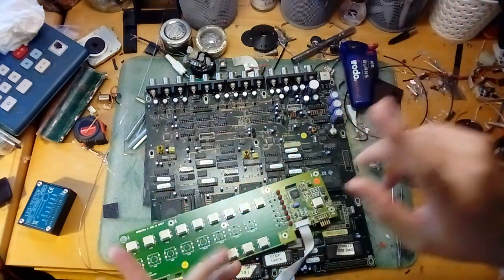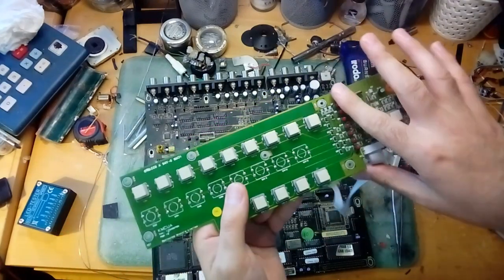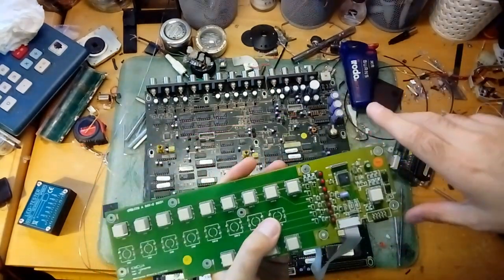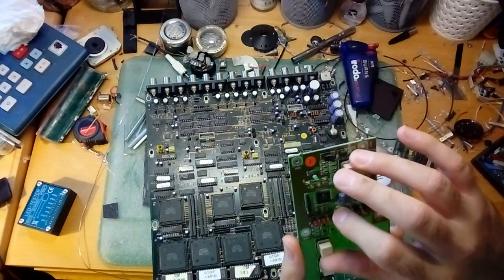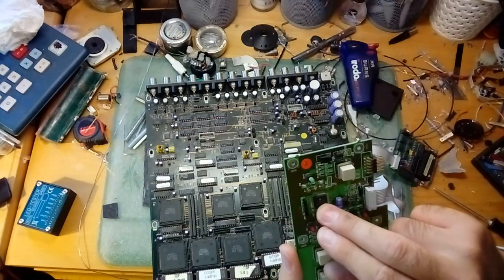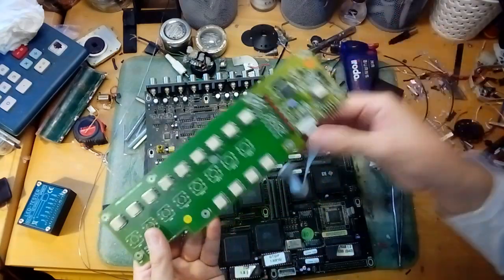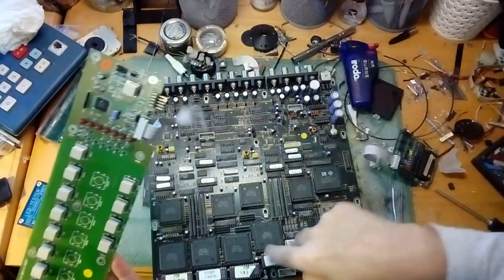Loads of 78L05 regulators, so this board is covered in useful stuff. There's a rather nice control front panel with an array of nice little 3mm LEDs, a multiplexed switch array that goes to a PIC microcontroller — a 1990s PIC microcontroller made in the 27th week of 1995. It is a PIC 16C64. I don't know if it's currently manufactured anymore, but it controls basically the button interface.